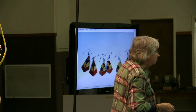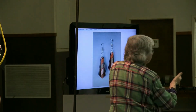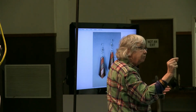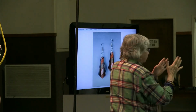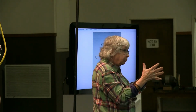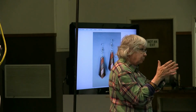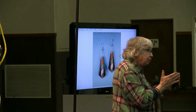Are we good? Okay, remember the 45 cut? Well, just take a couple of 45 cuts that are only about 1/8 of an inch big, and then capture it, put bigger pieces on the outside, glue it up, and then after you have that block, which was kind of good size, then you put on your angles and your shapes.